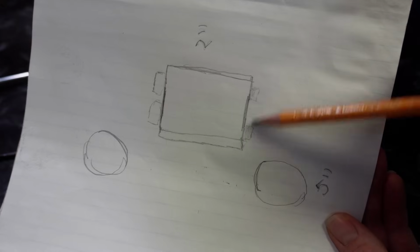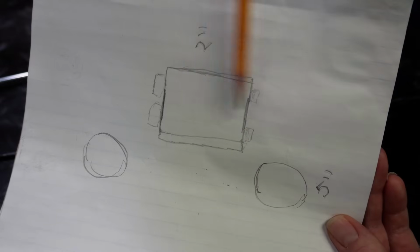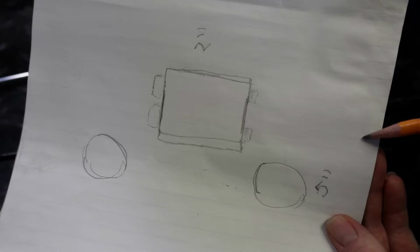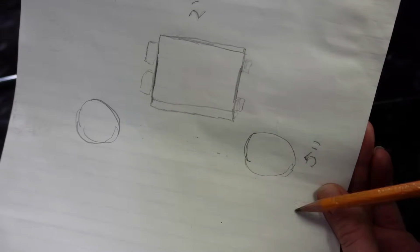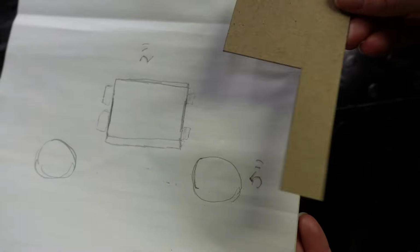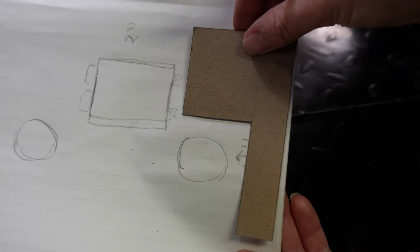So our block is going to be cut out of our 3/4 inch plate. It's going to mount onto the side of our motor mount here, and then it has to come out around the frame, out back here somewhere, and that's where our heim joint is going to attach onto there. So using those measurements, this is the template that we've got, and that's kind of what our piece is going to look like, and that's how it's going to sit in the bike, just like that.